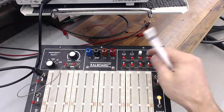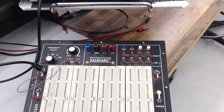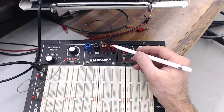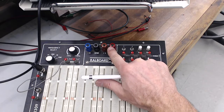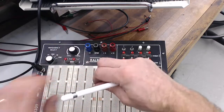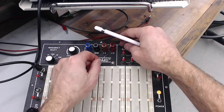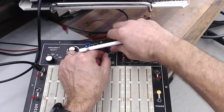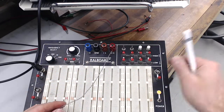You connect to the switches using the same push-button technology. There's another coax on this side you can use for convenience. The other thing to know about are the DC power supplies. There's only one conductor in the banana connector, but you can also unscrew the banana and find a little hole inside to clamp a wire. So you can either use the banana or this little crimping to connect to, say, the plus 12 supply relative to the chassis.